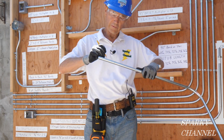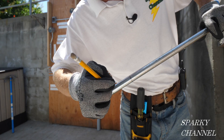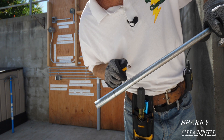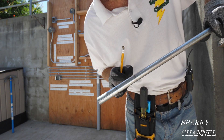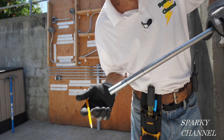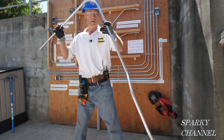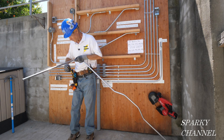You want to go all the way around — a mark at 2 inches and a mark at 4 and a quarter inches, giving us 2 and a quarter inches between the marks. That's exactly what we need for a 10-degree box offset with a 3/8-inch rise.